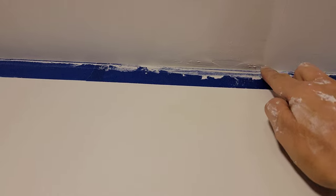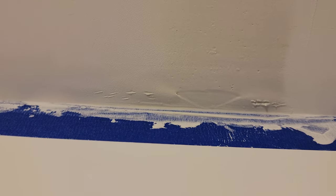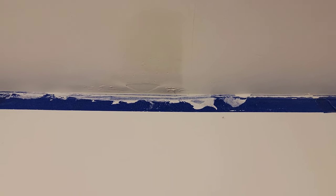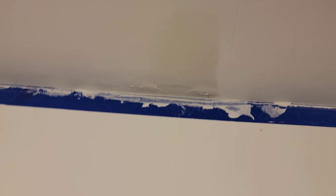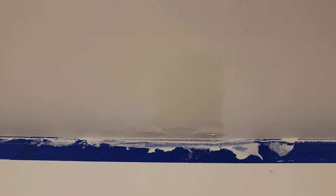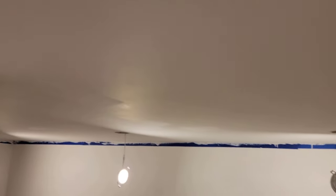I didn't cut enough, did I? It's so much bigger than I thought. Now at least I understand why it didn't fix. And the water from the mud — oh. So I may have to cut more of that out, but then I can't actually mud it until I prime it first so that the water from the mud doesn't sneak in there. Or I have to use undiluted mud.